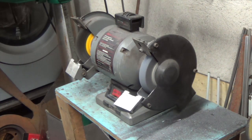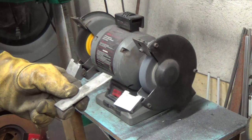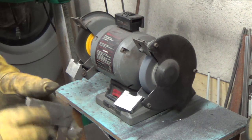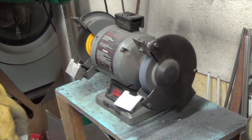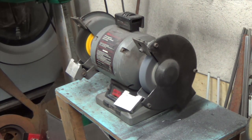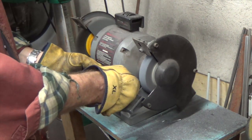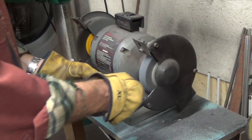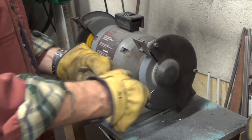So anyway, now I am just taking all the pieces and cleaning them up, cleaning up the edges. My edges are plasma cut, and my plasma cutter is barely powerful enough to cut through this steel, so the edges are often uneven, and when I welded them together I had to grind them down to get them close to the same size. So I'm having to run them through. Gonna need a new grinder soon. So I'm running all the edges through just to take off the burrs.